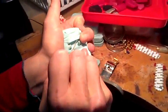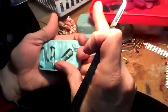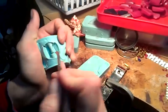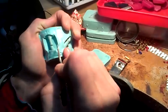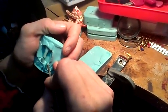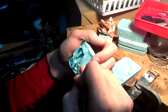It's to create a displacement area for the air when the wax goes into the mold, and those areas are lubricated with powder, the talcum powder. So in theory, it should work without it. This particular type of mold material is just so kind of perfect, and creates a seal because it's silicone. Like you almost technically shouldn't need this, but you still do for it to work.